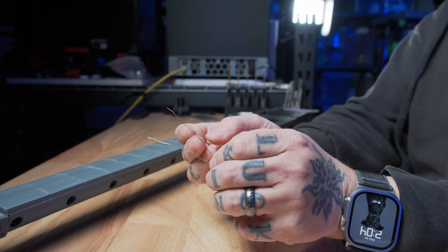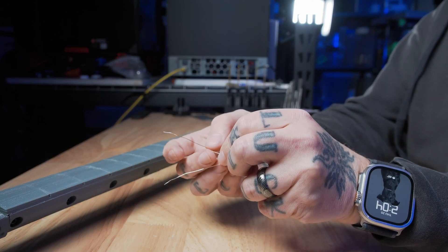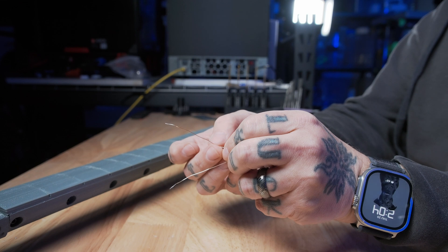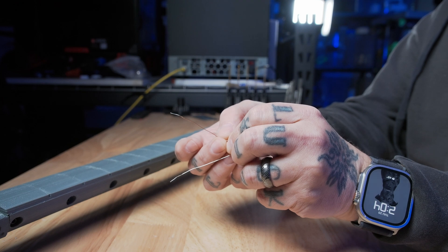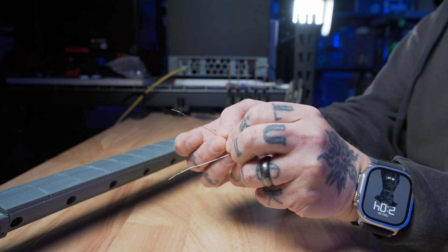When it comes to dealing with the lacquer insulation, there are a couple of ways to attack it. You can try scraping it with a hobby knife to get to the conductive surface underneath — that did not work very well for me, though some people do it. Some people use a lighter to melt it. I wound up using solder: get the soldering iron just under the wire, get a little blob of solder going so that it melts through the insulation and forms the joint itself.